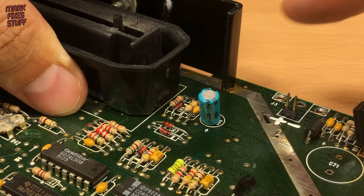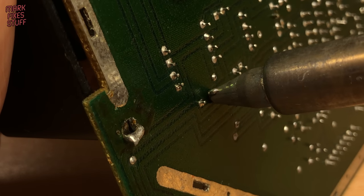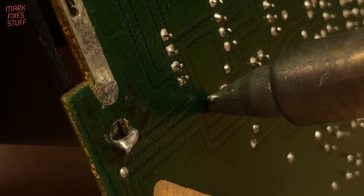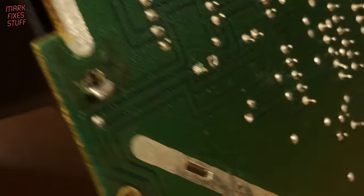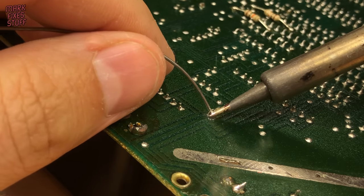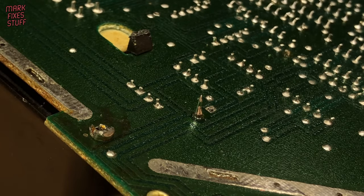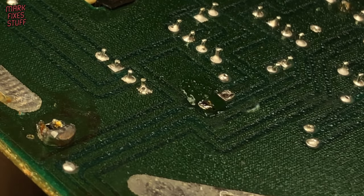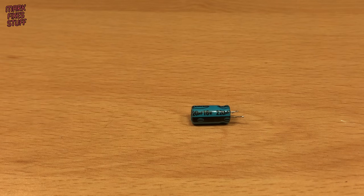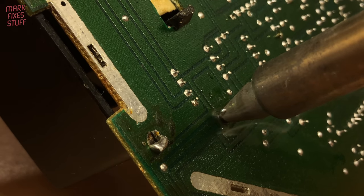I know it's going to be the same story for the next capacitor and this one as well — that ground plane wants to ruin our day. This time we'll outfox the board by applying a fresh blob of solder onto the joint whilst we're desoldering. The capacitor literally falls out of the board, but unfortunately the hole didn't clear again. More solder to the rescue — another go with another blob got the job done at last.